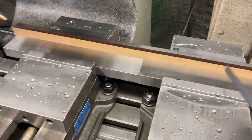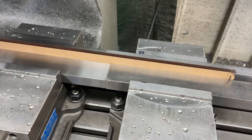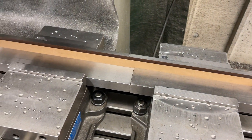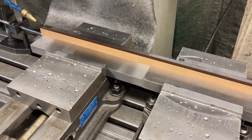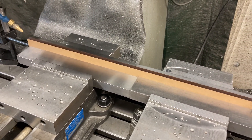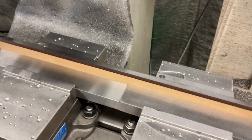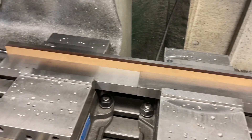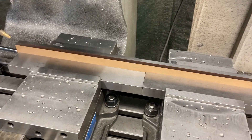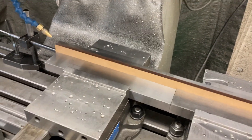These two vises are the ones I use together because they're within two thousandths of each other on height, so they're pretty damn close. Same with these parallels — banking up against it, pushing along the whole entire length of the piece. I edge find the back, check the two to make sure they're pretty close. They're within one thousandth. The plastic probably isn't any closer than that on its own. So I got it all programmed out and we're just going to put some holes in — 10-24 tapped holes.